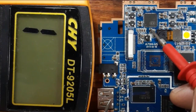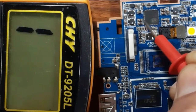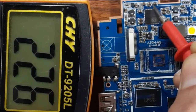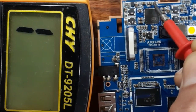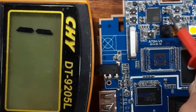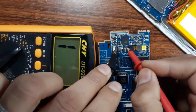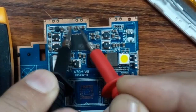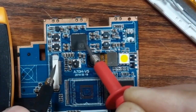This capacitor is connected to the ground on this side — good. Now this one: connected to the ground on this side, and this side. Let's check this one also: on this side — yes, good. Here to the IC, here to the ground, here to the ground — and this one here should not be connected to the ground. The same for this one: connected to the ground on one side. You can check each pF capacitor using the probe — if you hear a buzzer or get continuity, it means there is a short circuit, either in the ceramic capacitor or in the IC.